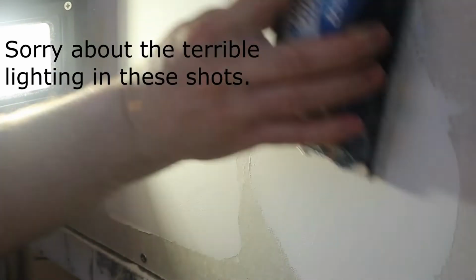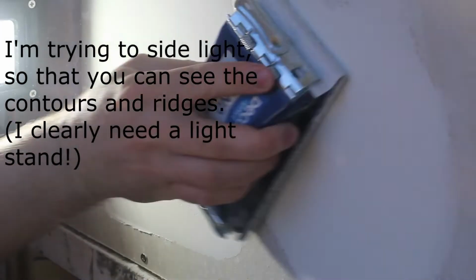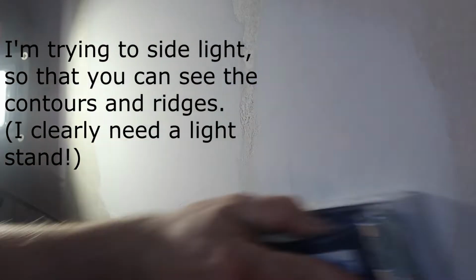Lightly sand with 120 grit sandpaper and then switch to 240 grit. If you still have dips or small air bubbles at this point, you can add another very thin coat, going back to pushing quite hard with the trowel. You shouldn't be able to feel the transition between the fill-in and the plasterboard.